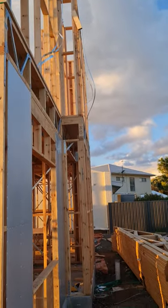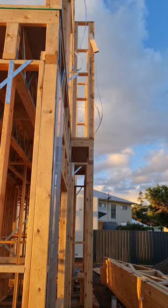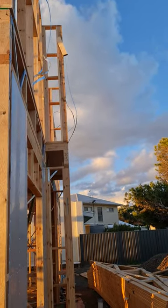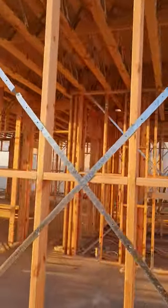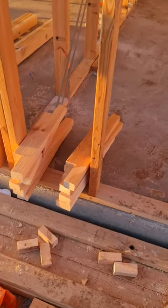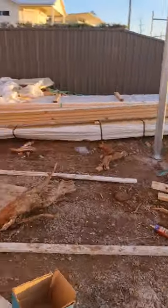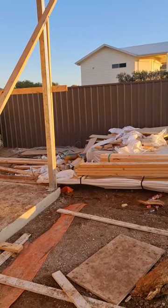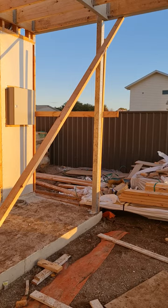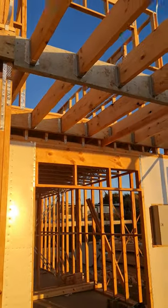I don't think they've nailed the top fully yet — the top wall frame is protruding around 10 to 15mm past the edge, so this still needs to be knocked into place. But again, really good work. Some material down here has been cut ready for the next part of the build, with all the timber through there. I'll wait patiently for the next section. It looks a bit more like a bay roof type setup. There's not much room to get rid of all the rubbish, and there's work around the top with the framing. That is video 2.